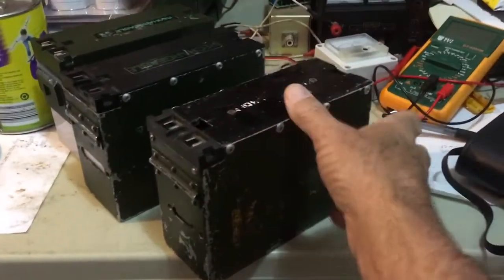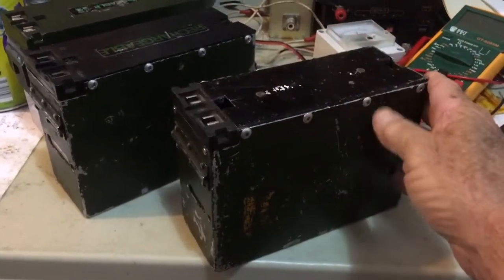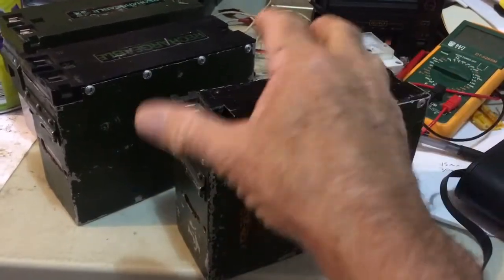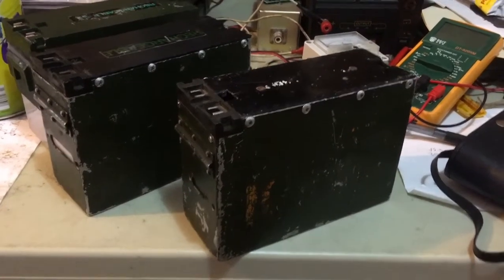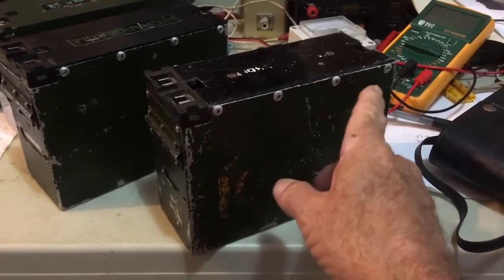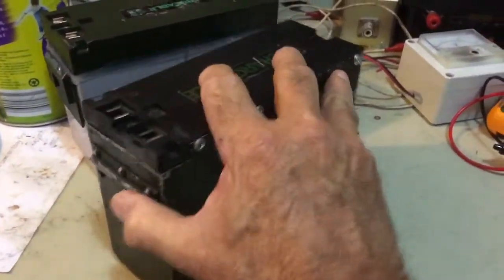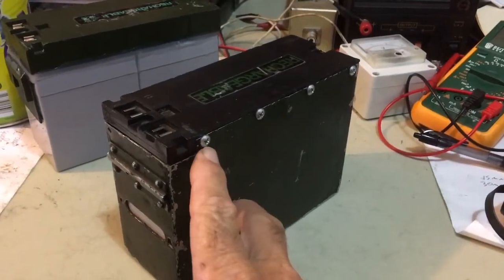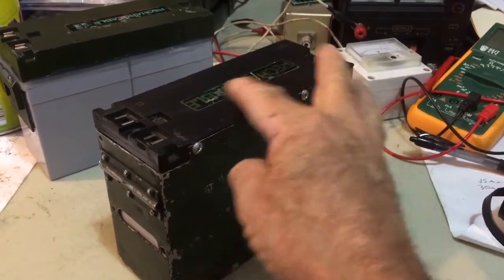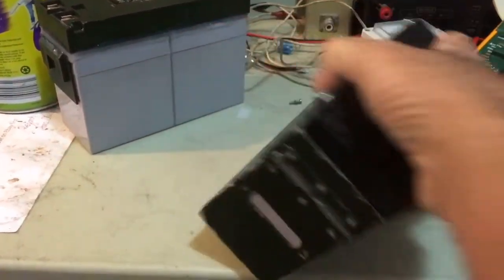In the past I've favored the metal-top batteries. Here's one I've taken apart and repacked with 5 amp-hour sealed lead acid batteries and re-riveted the top back on - that's been a fantastic battery. The next one is another repacked one, this time with a full plastic top and metal sides. I've been able to screw the top back on again after repacking it with the same 5 amp-hour sealed lead acid batteries.